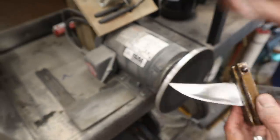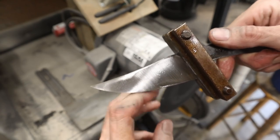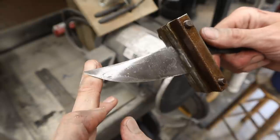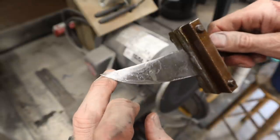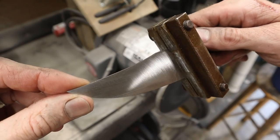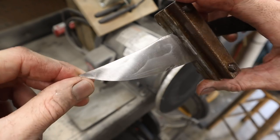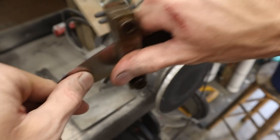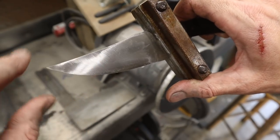Okay, I'm going to turn this off and we'll inspect this. I just spent one second over there, and what you're going to see immediately are the mistakes. So this is the flat that just got sanded — there's a problem spot right here. I can see immediately where I have problem spots. I've got a problem spot right there, and what that tells me is that while I was on the 2x72 grinding across, I rocked the blade just a little bit.